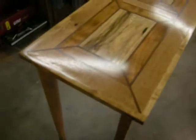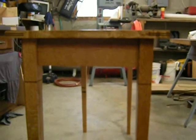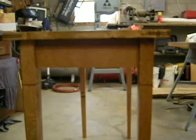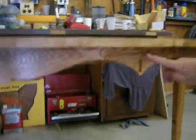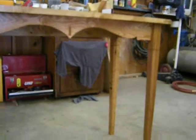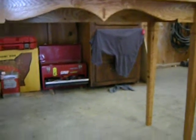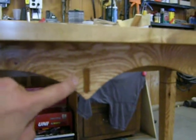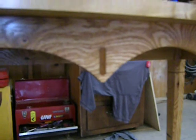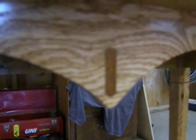The main part of the table — you can see the legs down here and the skirt boards, both the end skirt board and the front skirt board with this scroll work in there, and the back skirt board are all made out of recycled wood straight from pallets. You can see in the front of the skirt board right here, we took a router and cut out the nail holes and applied a piece of mahogany, which we got from Ray Ramirez's basement, to cover the nail holes.